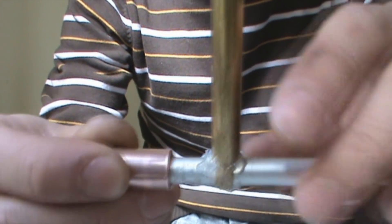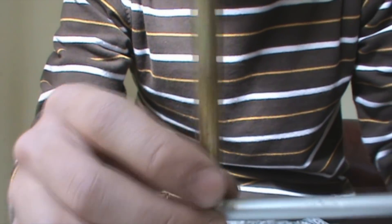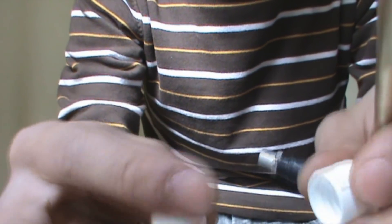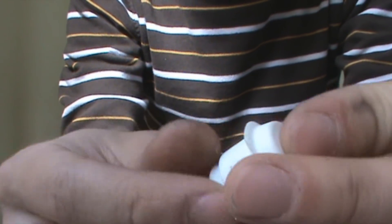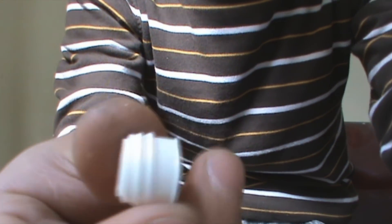I have glued the magazine on the barrel using hot glue, but you should use stronger things like epoxy or fiberglass resin. Now you need something to cap this hole — the best thing I found to use comes from a toothpaste cap. The BB passes from here perfectly; you just glue this part here on your magazine.